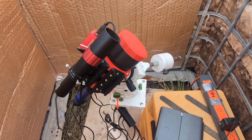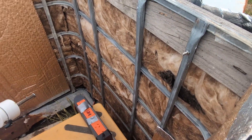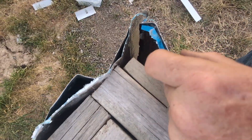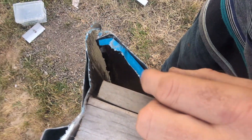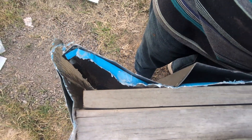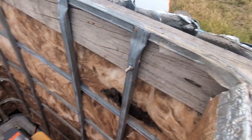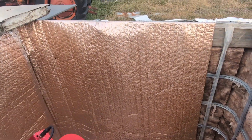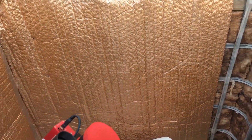That's the interior — it's quite small but fantastic for a smallish setup. We've got power, which I'll be mounting to the side. For insulation we've got moisture protection, damp course, so any condensation forms and runs down the inside. There's a reflective vinyl layer, then insulation wool, and then a bonus second reflective insulation layer.